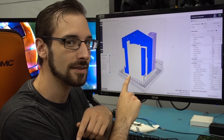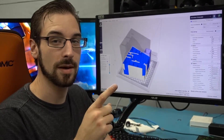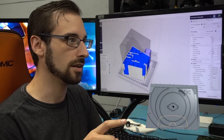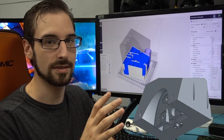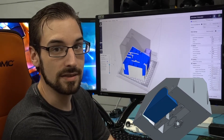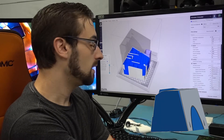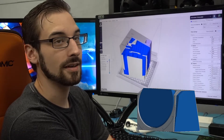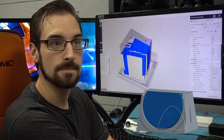That's why most other parts are done and we still have a long time to go. Also, that dissolvable support is a lot more expensive than regular plastic, so when I have large areas that need to be filled, I'll just make a new part in my 3D CAD that fills most of the space. That's why you see these large extra pieces that won't be part of the finished product. If you look at my CAD designs online, you might notice those parts called carrots — I always call them carrots because I can. Don't judge me.